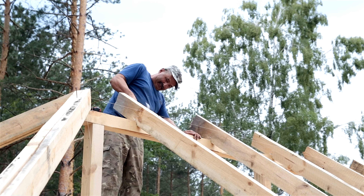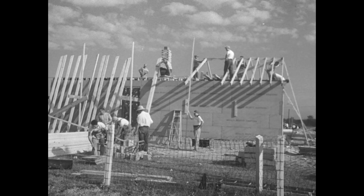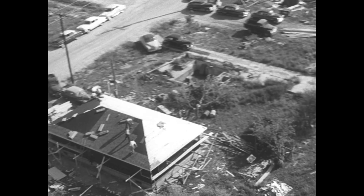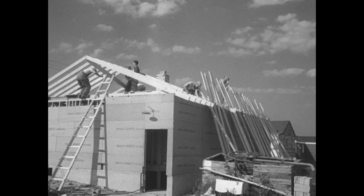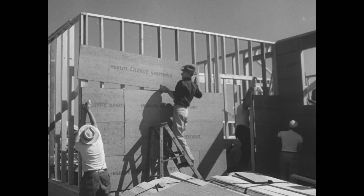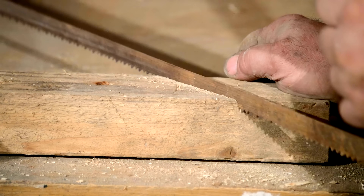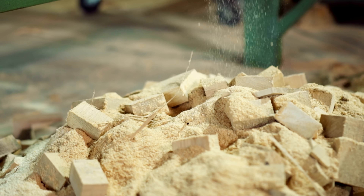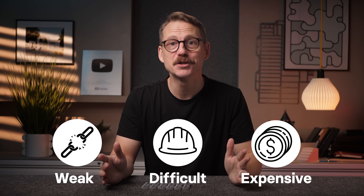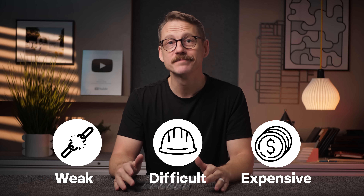It's in places like this that the roof was failing. Not only that, but all of these angled cuts are exactly where the carpenter's skill is being put to the test. Any small error in this area is magnified into weakened construction, and it's where you waste a ton of wood. Every angled cut leaves scrap that just gets thrown away. Weak, hard to make, and expensive — that's hardly what you want in hurricane-prone Florida, or anywhere for that matter.